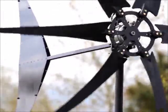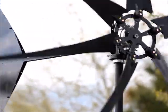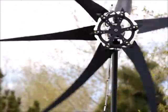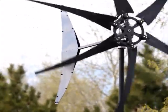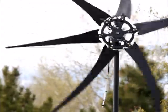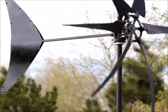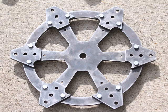What we're looking at here is a Missouri Wind and Solar 24-volt alternator with a 17-millimeter shaft and Thermodyne KT blades mounted on my new hub. A lot of you have these turbines or something like them. If you have a test station, you may be interested in this hub — that's kind of the point of the video. What's unique about this hub — and you'll see it here in the CAD program — is I want the air to flow all through the hub and around the roots of the blades, and of course get a greater blade diameter for increased power.